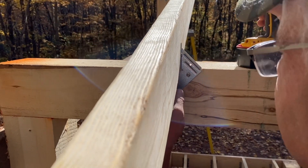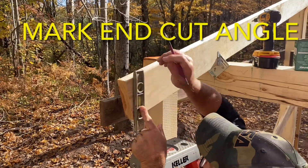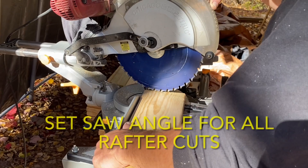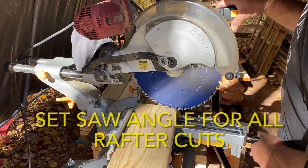We actually did this kind of assembly line style. We put up all the rafter ties first, then placed two rafters near the ends of the saw shack and determined the cut angle for each rafter end cut. Once the saw was set at that angle, we were able to make those cuts very quickly. I think we spent maybe 30 minutes getting all the rafters cut. This worked out really well — very fast and efficient.